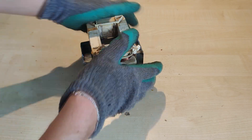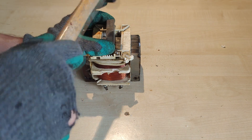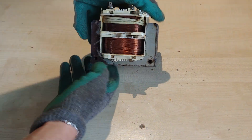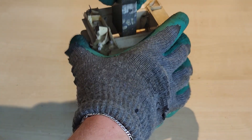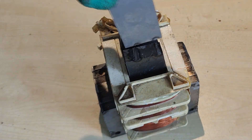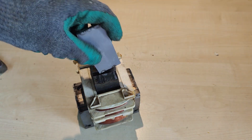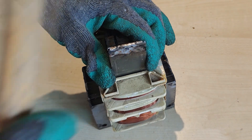Now it is time to mount the second coil, and tap it firmly in place with a small hammer. The goal is to reduce the space between them as much as possible, so as to be able to mount all of the other coils one by one. Remember, there will be in total four secondary coils and one primary on this transformer. Now you can see why I cut the middle part of the armature earlier — in order to mount so many coils, I had to find a way to extend the magnetic circuit of the iron core, to create an easier path for the magnetic flux to permeate through the windings. If you have any recommendations on how you would have done this easier, feel free to leave it in the comment section.